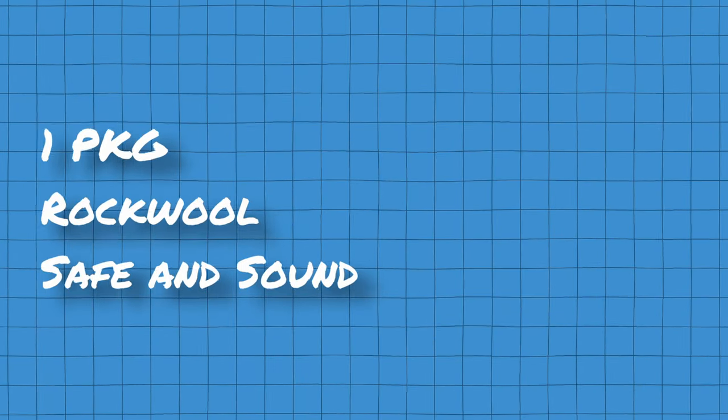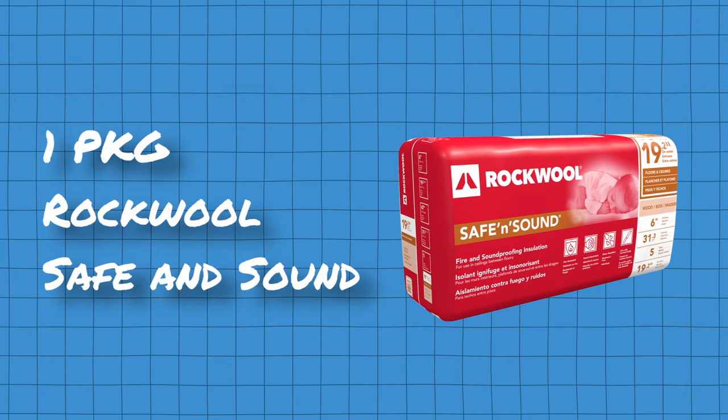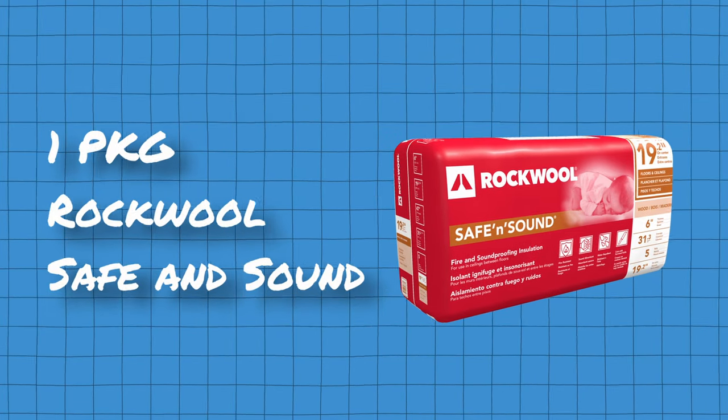Here are the exact materials that I bought for this project and how much each of them cost me. This is to make 12 acoustic panels. The amount of acoustic panels you'll need depends on your room size and shape, and I'll detail how to figure that out later in the video. So be sure to watch this whole video before starting this project. The reason we're making 12 is because 12 happens to be how many insulation panels come in a full set. The first item you'll need is Rockwool Safe and Sound, which comes in around $60. This is the 12 insulation bats I was talking about.